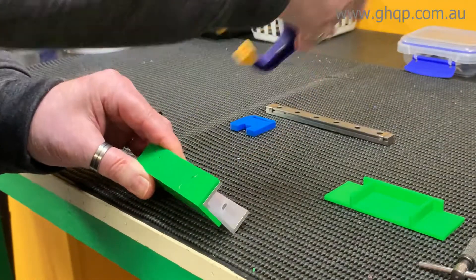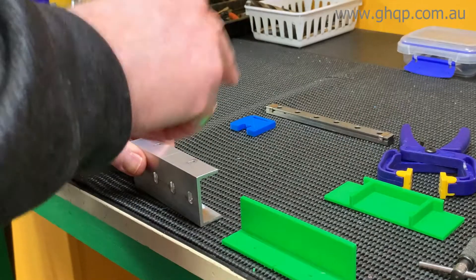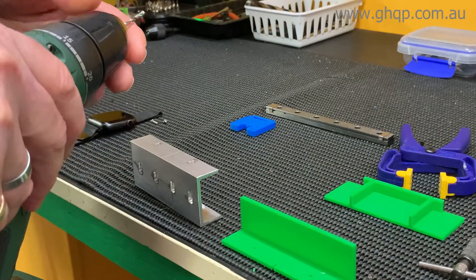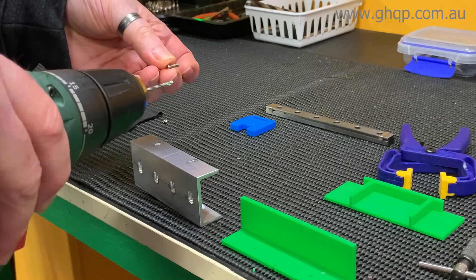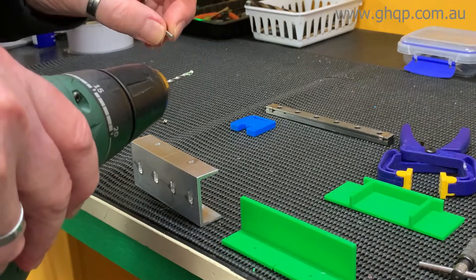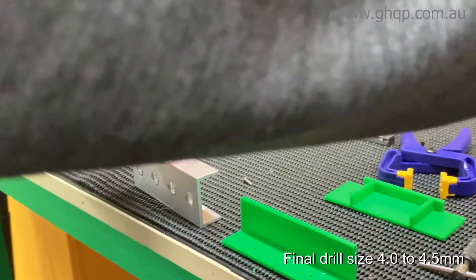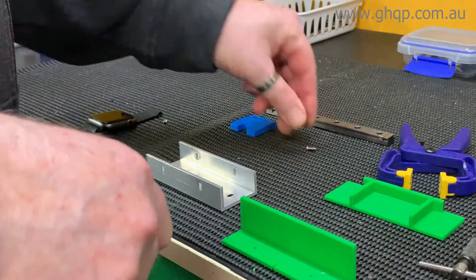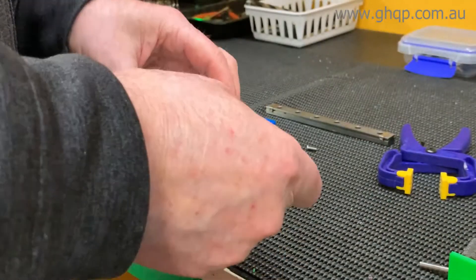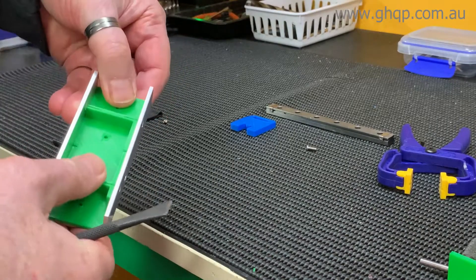Once you've got that lined up, put a clamp in there to clamp it into position, then go through — these are 2.5 millimeter holes, just pilot holes — and drill those in. Once you take that off, swap it around and do the other side. I recommend that once you've done that, change the drill over to 4 millimeter — even though it's a 3 millimeter screw going in to hold the T-nuts — give it a little bit of play. Drill these to 4 millimeters, maybe even 4.5, because that still gives enough for the head to grip. Then slide the first jig back in to double-check that those side holes are in the right place.